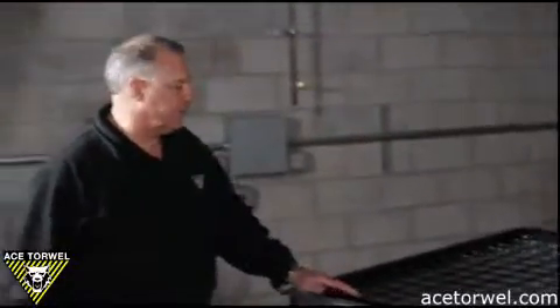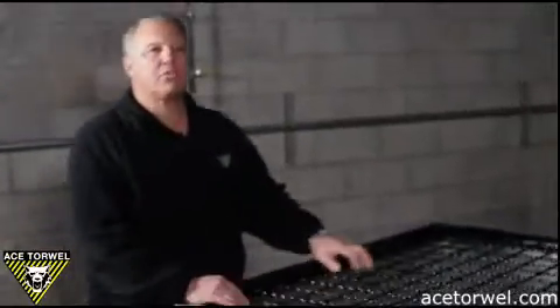Our units are different in the fact that we use a woven mesh rather than a welded wire mesh. Across the top of the hopper, we weld in a balanced lifting eye, doubling as two supports. An optional inverted V is mounted on the inside of the hopper to help prevent the bridging of the sand, and it actually takes the sand and pushes it to the outside wall of the spreader.